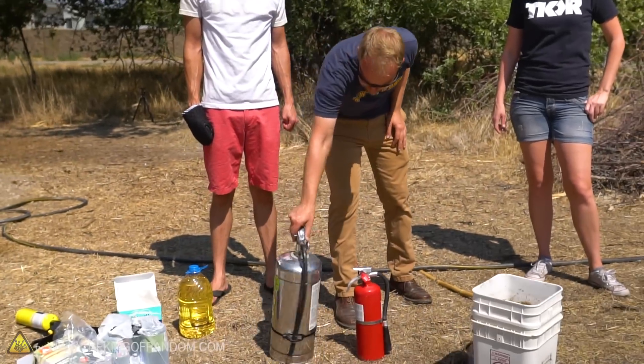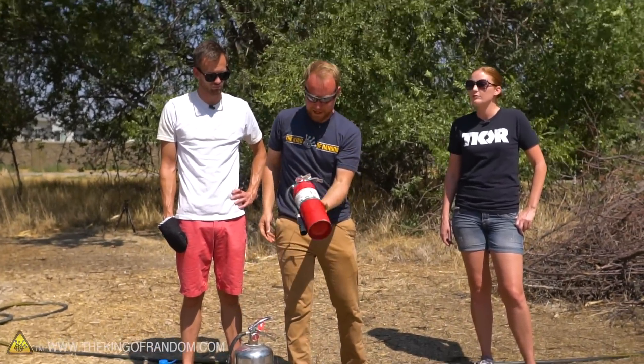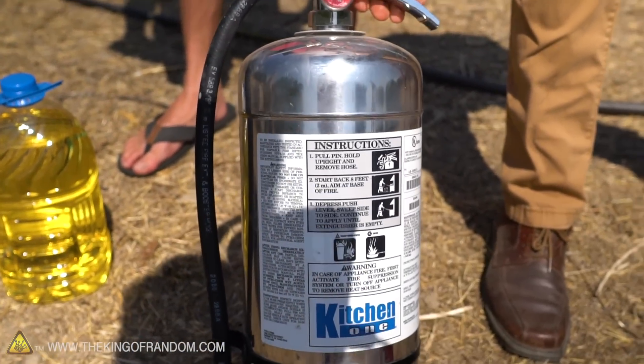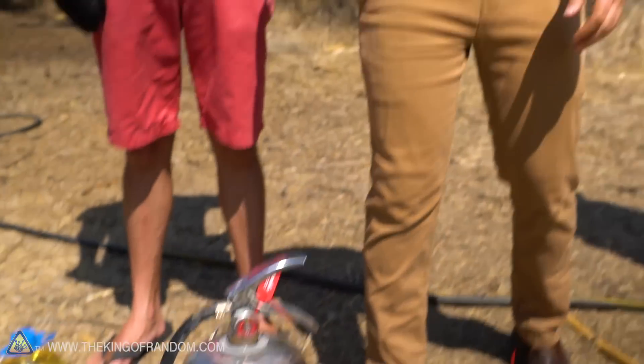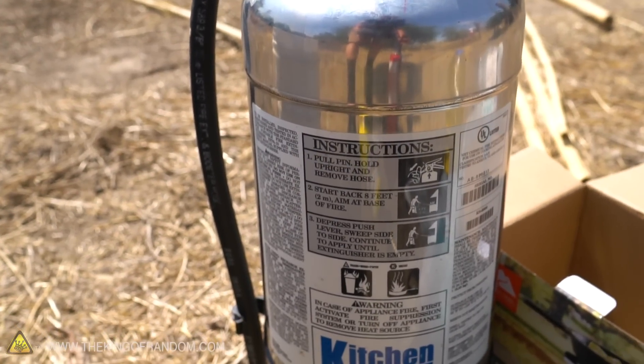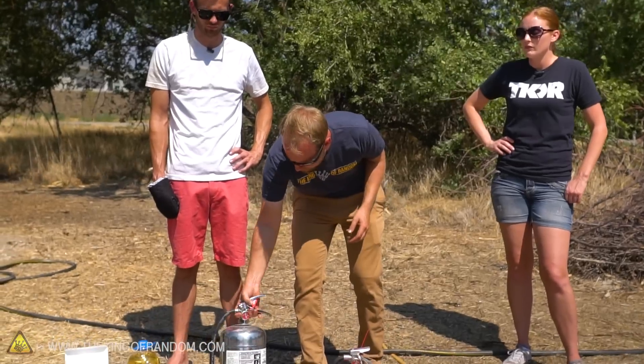So here we have two different fire extinguishers. This one is a lot like the normal ones you'll see. Then this one — probably many of you have not seen before — is a larger one; often these K-type fire extinguishers are silver. Different fire extinguishers are rated for different kinds of fires, and this is very, very important because if you throw water on a grease fire or an electrical fire, you will make the problem bigger, not smaller. So normally in your house you're going to have what's called a class ABC fire extinguisher — the most common to find commercially available. But this one is class K.